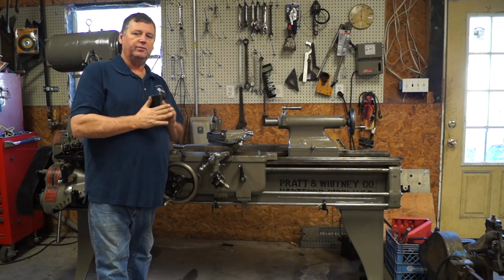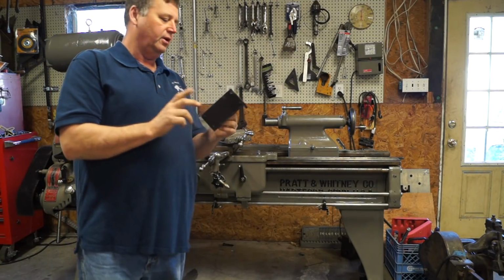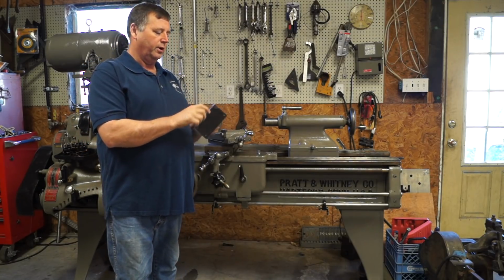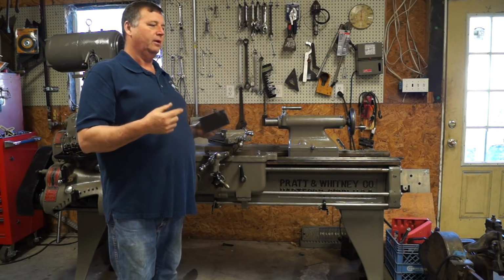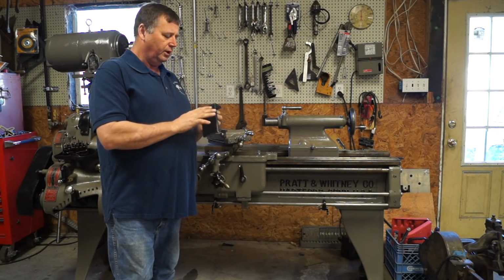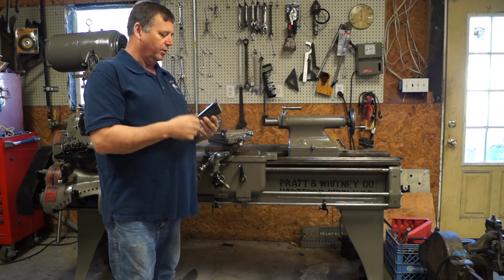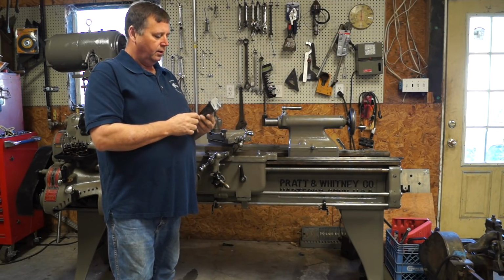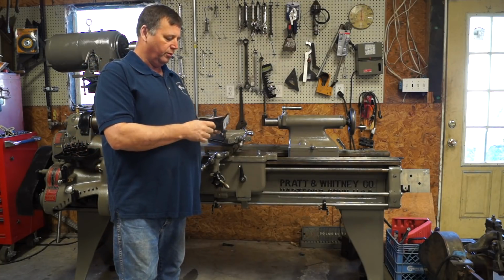Alright guys, that pretty much wraps up the bracket video, and it turned out real good. There's a couple of things. The biggest thing is, originally when I laid it out to drill the holes, I was thinking I was going to use a 1/4 inch, and then I laid it out at 3/8. You can see that in the video when I made the two different size comparisons. But anyway, I should have stuck with a 1/4 inch and everything would have been perfect. The only problem is the holes are in the radius a little bit, and it isn't going to cause a problem. Just have to use a shorter screw where it won't come all the way through.